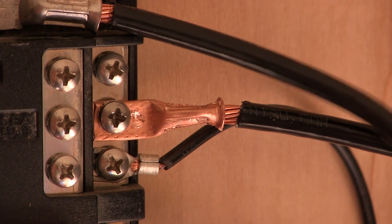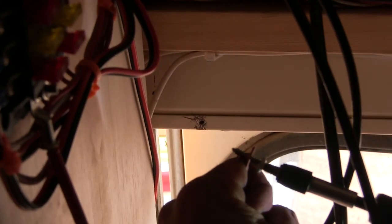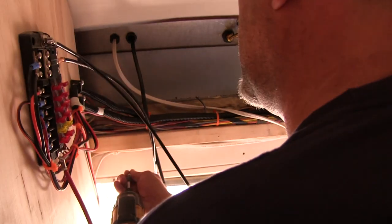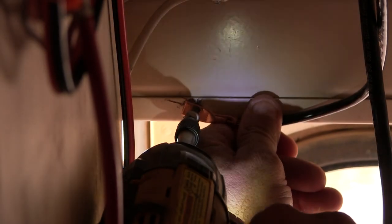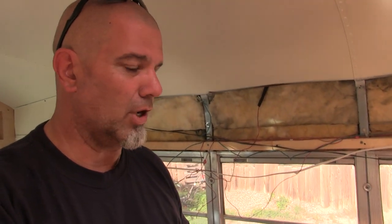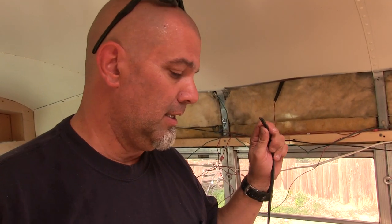I like your homemade thingy. How many times are you going to drop that screw? All of them. I used some thin wire for the pump, but it was too thin — it's just not drawing enough current to really run the pump very well. So we're going to up it quite a bit to a bigger gauge than it actually needs, and that's good.